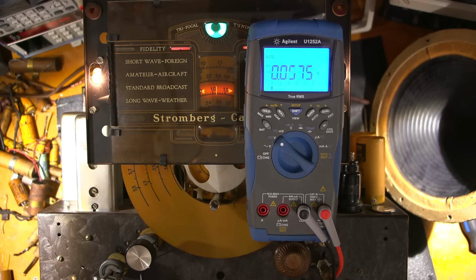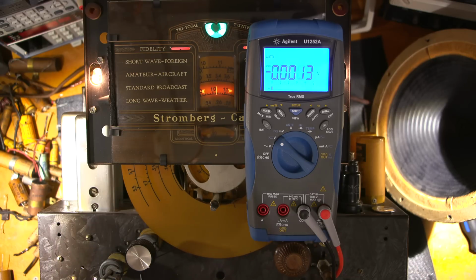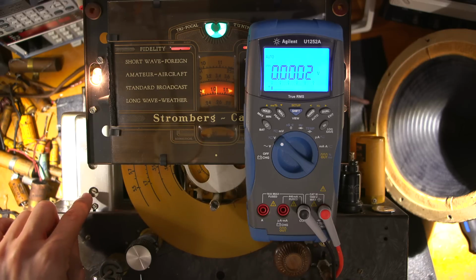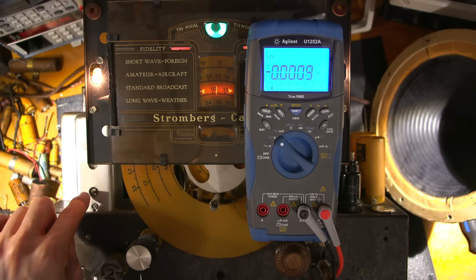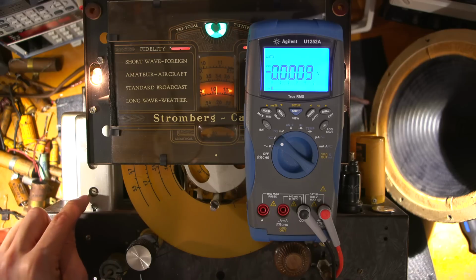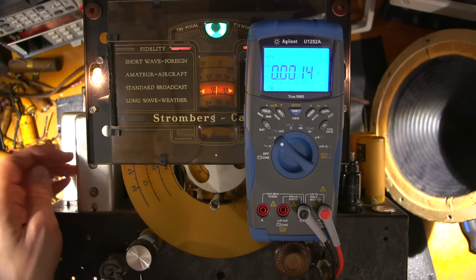I warn people about this a lot. Some radio receivers, the actual adjustments in the IF transformers are live. They have full B+ on them. So if you turn these with a standard metal screwdriver, and if they were live and you slipped and touched the case, I don't know if you remember the game Operation, something like that. So this thing will end up shorting to the case, and you can damage the IF transformers. So you got to be careful around devices like that.